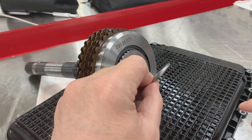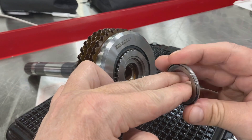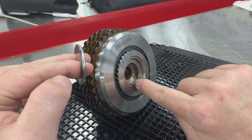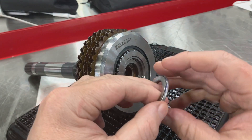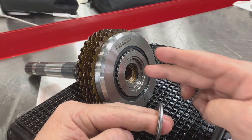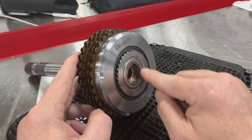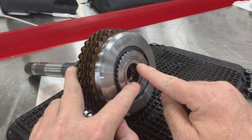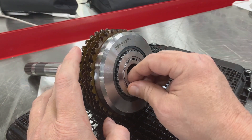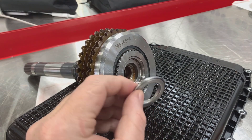If we turn it over, there are a couple of problems. The outer race rotates at a different speed and even a different direction than the inner race. So if that outer race is fitting in a groove and the inner race fits on a flat spot, you're making this bearing spin inside of a metal-to-metal contact housing — which we never want. It can burn itself up rotating inside the metal housing it's supposed to sit in. The proper way is for the inner race to rotate while the outer race stays with the housing.